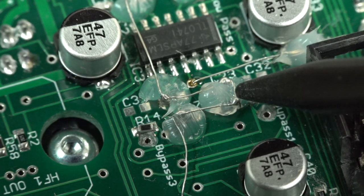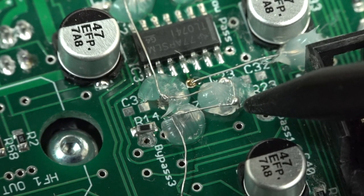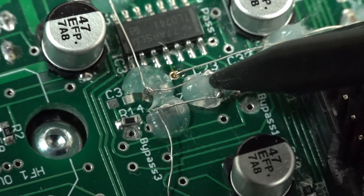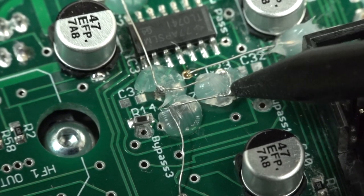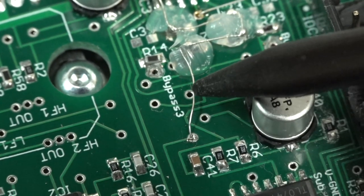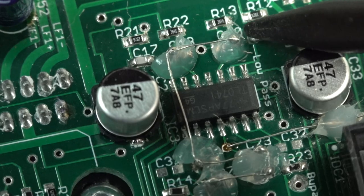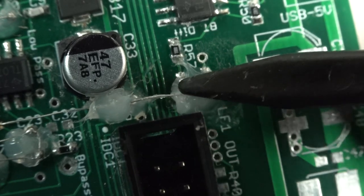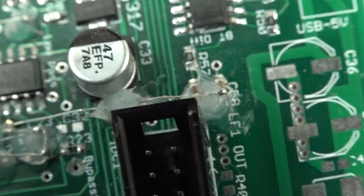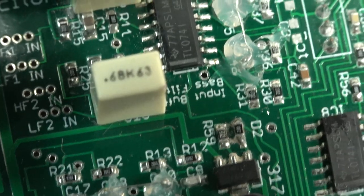And we can actually see the bodges down in there. These points here are actually soldered to SMD capacitors or resistors going down to a point in there, and yes, that is silicon, that's not hot snot. So there's a component here, component here, component here. So they're using this like a trace, snaking its way over like that. I think there's another one in there. There's another one in there. There's another bodge over here. There's a couple of caps down in there. In the time-honored tradition of do-it-yourself kit design, yep, there's mods everywhere. That's more.